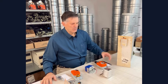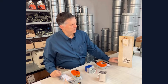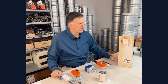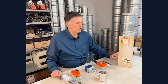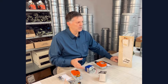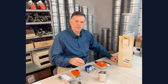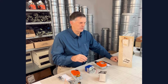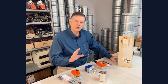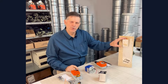Today we're going to talk about our most popular replacement motor, the RZ31. Here I've got a Honeywell damper with a failed Honeywell motor — this is probably our number one replacement motor. They have plastic gears in them. It's a two-wire spring return motor and they don't tend to hold up well in the field. Some can last a long time, but some don't last very long at all, and if you find yourself replacing these motors every few years, it's time to try some different options. We have about four different motors to replace these Honeywell or common footprint motors.